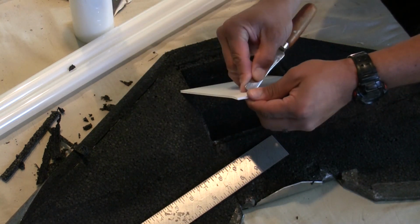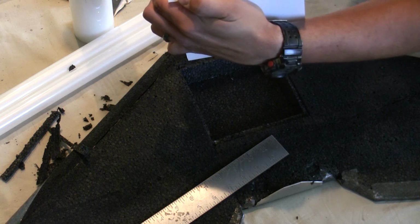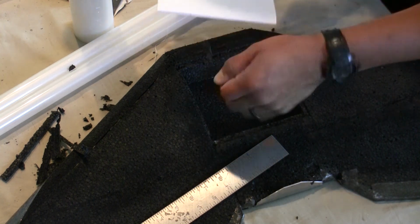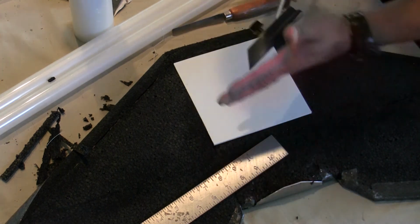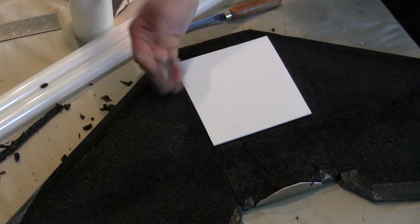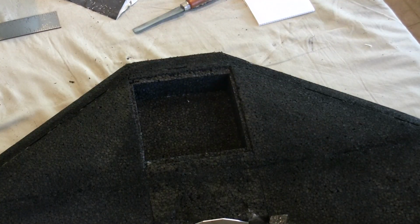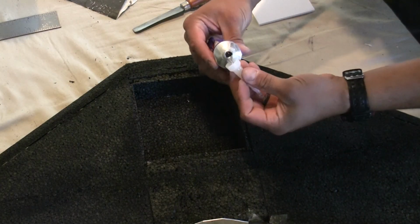After I cut the hinge in, I will add the Gorilla Glue on the front of the wing and let it fully dry for about 2 hours, and make sure it sticks really well. The Gorilla Glue will penetrate the EPP foam very well, a lot better than the EPO foam.